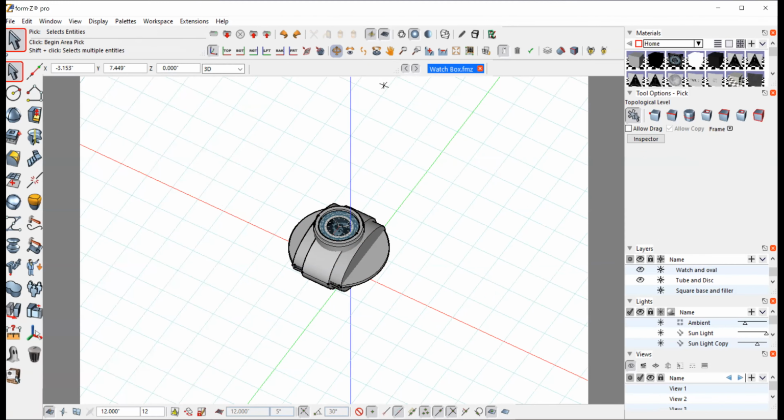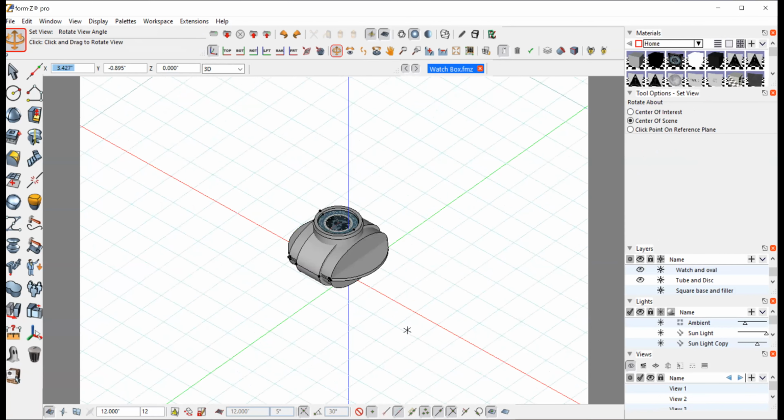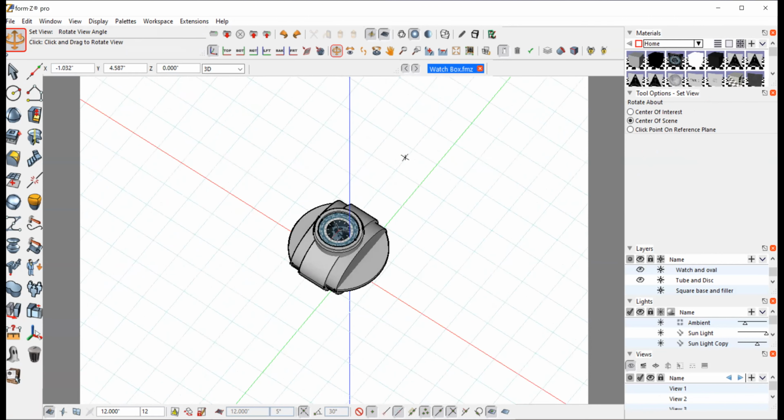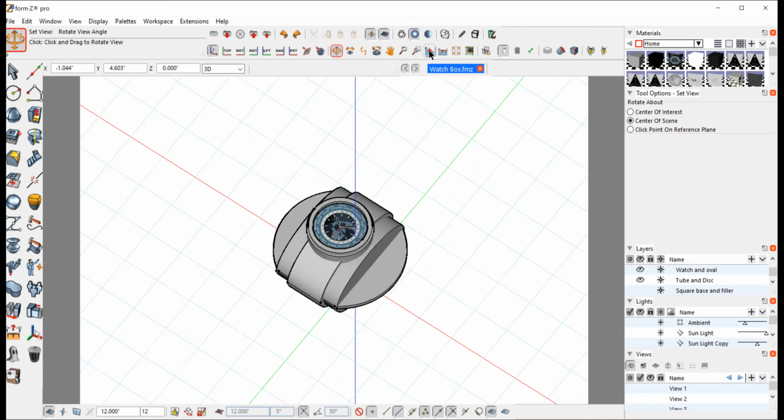So I'm going to develop all this 3D geometry and then use that as a guide. It'll be more like a shop drawing. If anybody has taken wood shop and they built like a birdhouse or a step stool, you're not developing a die line, but you're developing an assembled drawing of the part and what it looks like. And you're looking at it orthographically and you're deriving all the, let's say, the cutouts and the notches and things that you need to do to fabricate that part.